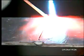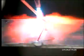As we melt a little of the 54C off as we go, notice the brazing motion that I'm using. I'm also taking the torch completely off of the aluminum as I move along.